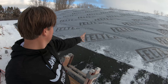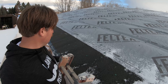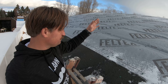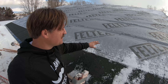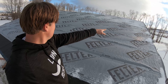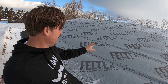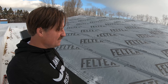You can see the synthetic felt blowing up from the heater inside. It's a 4/12 roof. I've got one row of ice and water shield on the dry-in — I ran out, so I put one row on and then a row of Feltex. When I get more ice and water shield and there's no snow on the roof, I'll likely take off that synthetic felt layer and replace it with true ice and water shield. You can see where the frost is on the overhang — all the heat from inside has melted the frost on the main roof but not on the overhang.